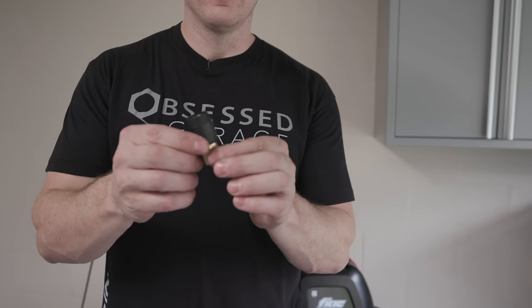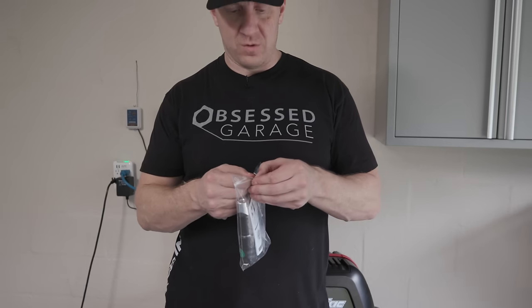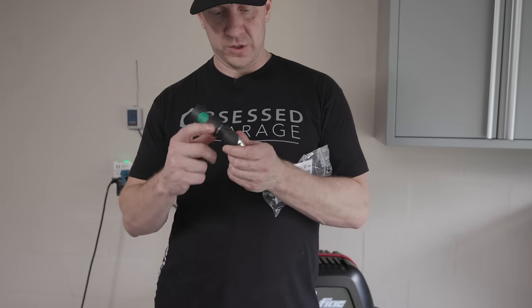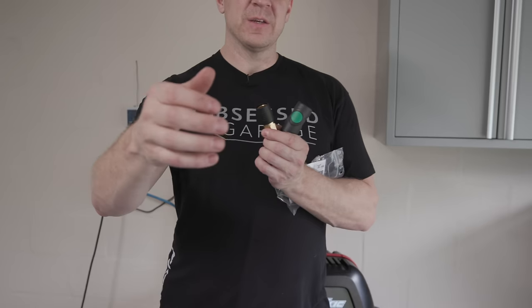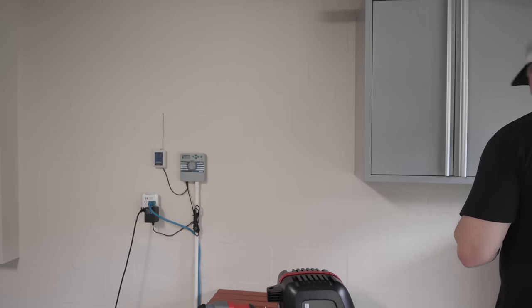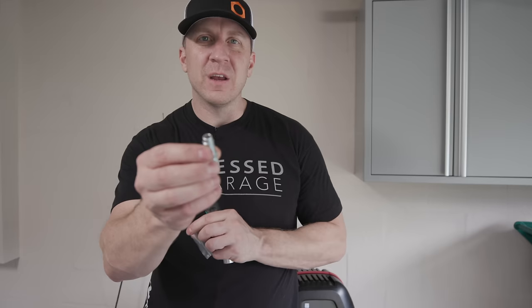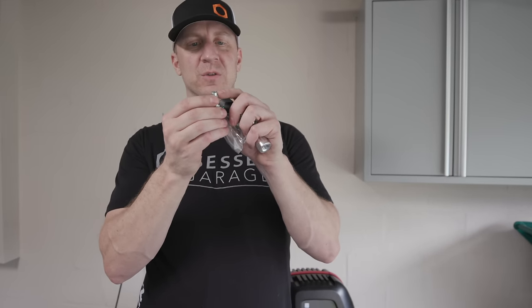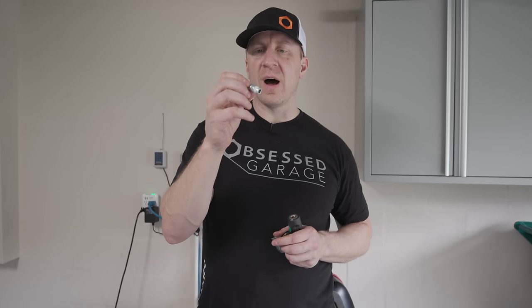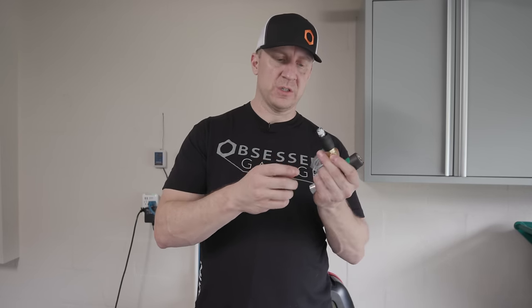We're putting on a Prevost ESI 07201 SW — the swiveling quarter-inch swiveling coupler — and we're sticking with Euro high flow. So if you buy this and plan to use the fitting that comes with it, just know it's Euro high flow. You'll want to buy some Euro high flow plugs — they're about a dollar twenty-five or two dollars. You'll notice the hole size on Euro high flow is much bigger than a standard industrial fitting, and there are many different standards, so make sure you have the right one.